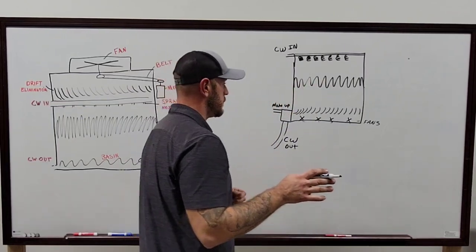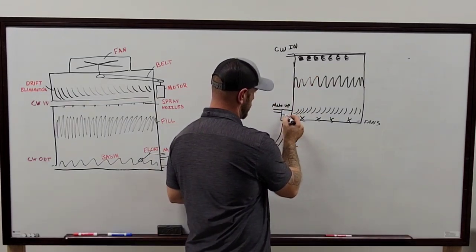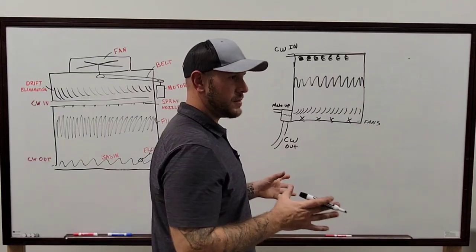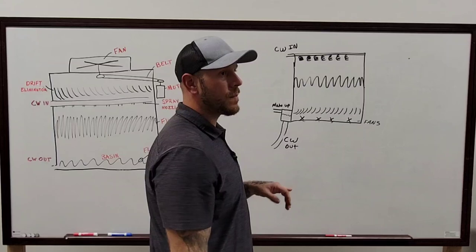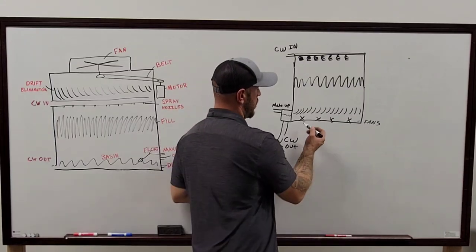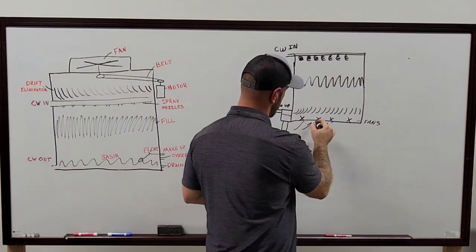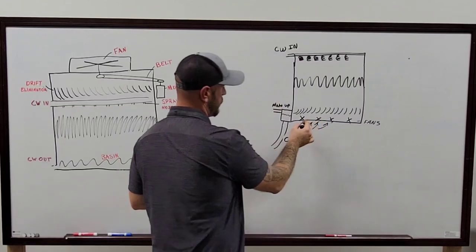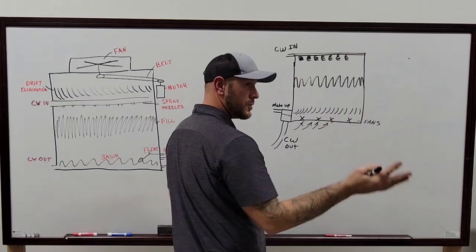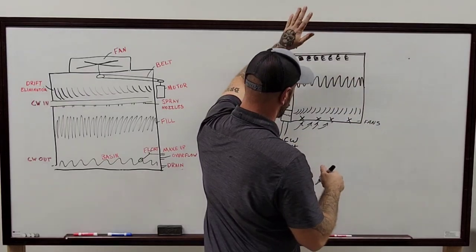So on this one, the only amount of water that's really staying in here is in what is it, like a 2 foot by 2 foot box that's on the side of that thing? Yeah, it's just a small trough. But I haven't seen how big the troughs on the sides are. On this one you have the air being pulled in through the bottom from all the fans. Then you have these louvers right here on the top of those fans, which open up to direct the air straight up through the tower, so that it blows through the fill and all that stuff.